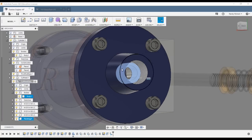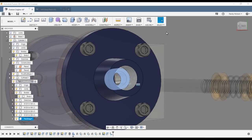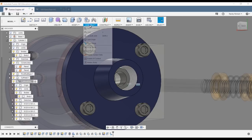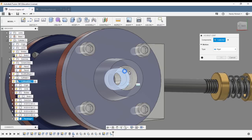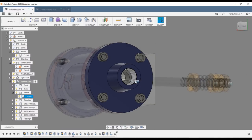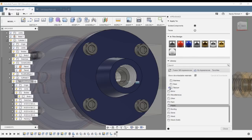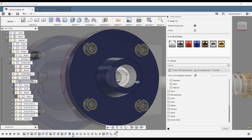It looks good. Remember it's just drawn in place but sitting there loose — I could grab it and drag it, but we don't want that. So let's make an as-built joint on it — click on that and click on this, rigid — that way it stays there. For appearance, let's make it out of something white — ABS white, or any white plastic will do.